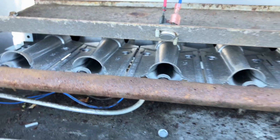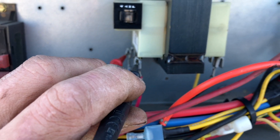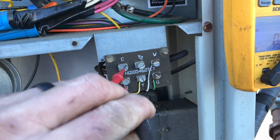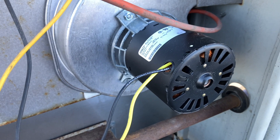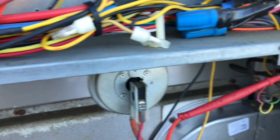Inducer is running. But we're not sparking. Why are we not sparking? So I've got power across the transformer, but not to my thermostat — but my inducer is running. Tell me we got a bad control board. I'm just saying it's an option. All right, we got power leaving down this red wire to... oh, I know where it goes. I gotta take the top off.